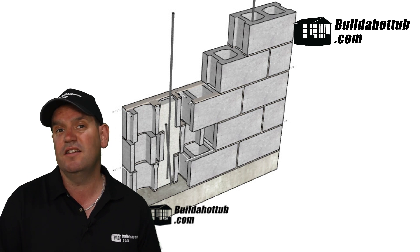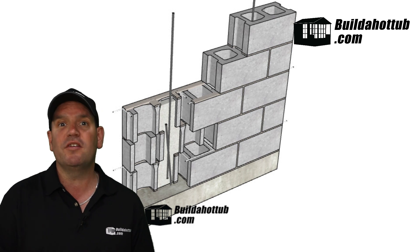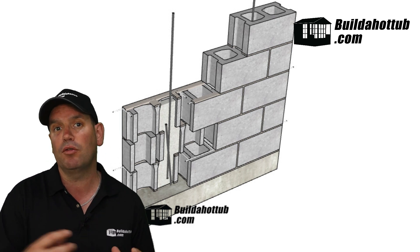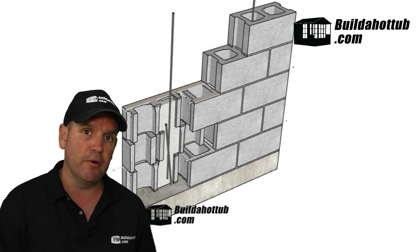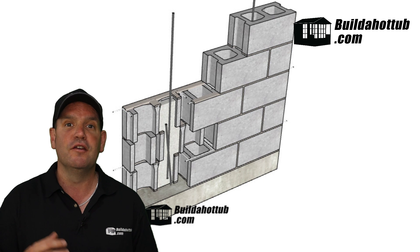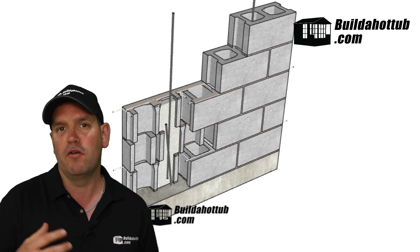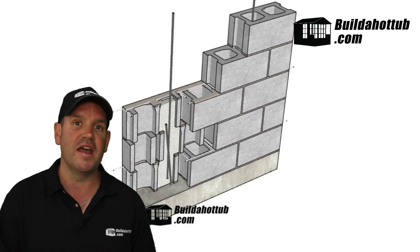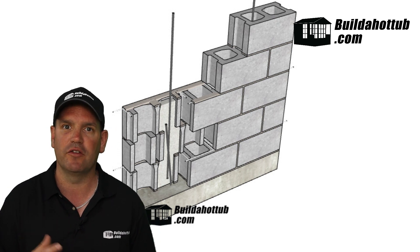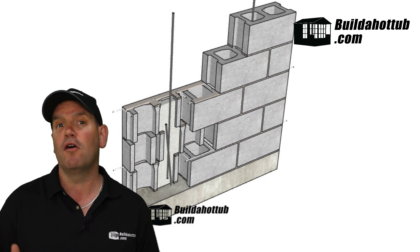The main advantage here is the price — it's a really cheap way of doing it. Top tip: core your holes and fit your gunites going through the blocks before you put your rebar in and certainly before you pour the concrete. It's a lot easier to cut through a hollow CMU block than through a block you've filled with concrete with rebar in the way. So just fit your plumbing before you actually insert the rebar and pour the concrete.